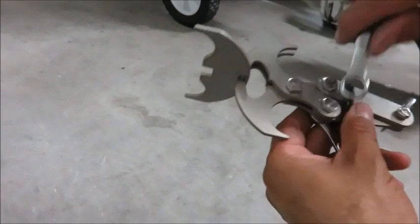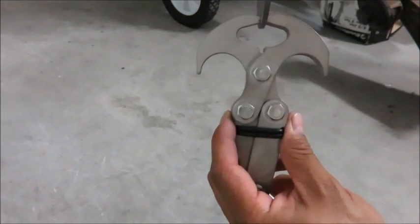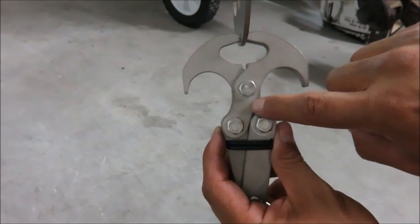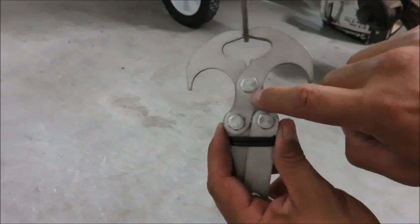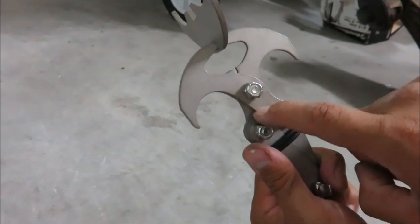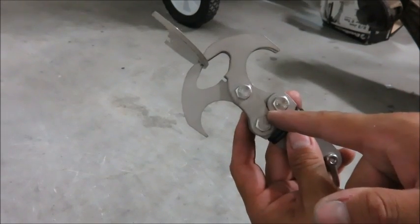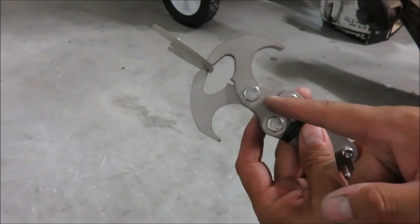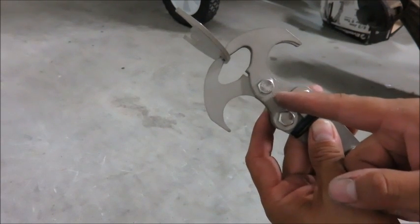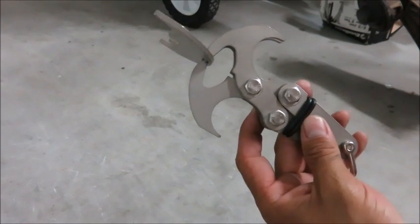You'll want to tighten at least two of the bolts. Now what we want to do is drill a hole on this side of the hammer, but we want to make sure that when it's drilled all the way through, it's not too far or too close to the edge on either side. We're going to line up this center point all the way up to the center of the bolt, all the way up to this notch here, and make a center punch mark right where we need to drill.